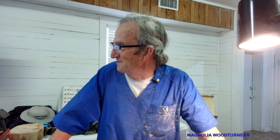When you get into the deeper bowls, think of how much, I'm dealing with a possible 6-inch overhang and trying to get into some stuff. Very easily when you just get a deep bowl on it. How much impact does the size of your gouge have on that overhang? It has a significant impact.